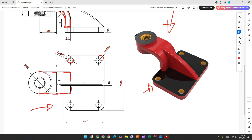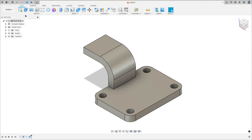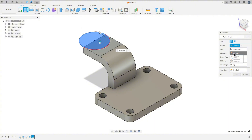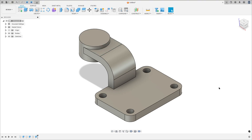Now we will make this cylinder here. This cylinder has 40mm of diameter and the length is 25mm — 5mm to one side and 20mm to the other side. Go to create a sketch, select this face here, select a circle tool, take the center of this edge, make a circle of 40mm, finish the sketch. Go to extrude, select this profile, select 2 sides: side 1 is 5mm, side 2 is 20mm, operation join, press OK.